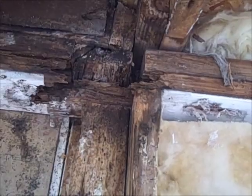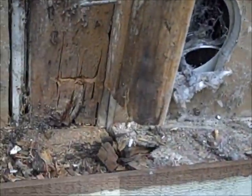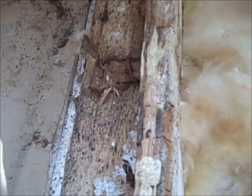What we're going to do is — because we can't get all that out of there — I'm going to cut the top plate, that top 2x4 right there. That's a T that goes into a closet, laundry room right there. We cut the bottom already, right there, see. We're going to put a bottom plate right across that. And we're going to do the same thing up top — add another top plate right across it after we cut that out, take out this little piece of key inside here, and make that a solid piece.